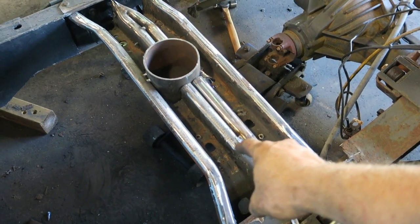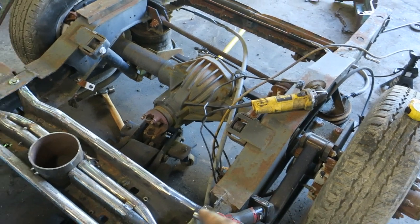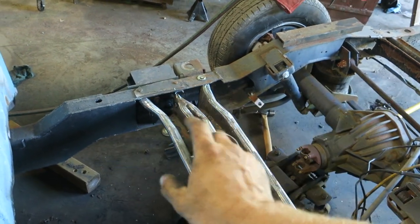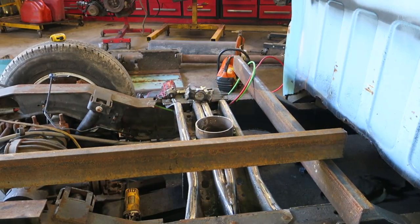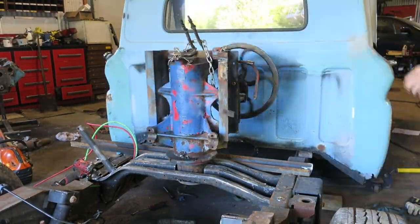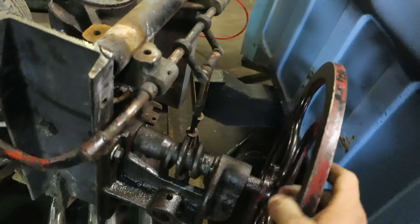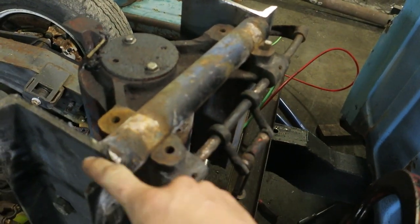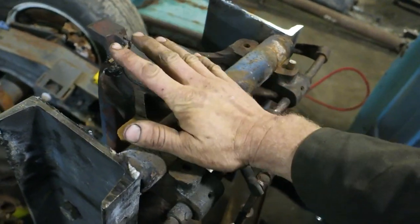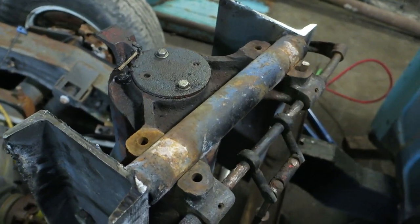We've got the frames tacked in place. The only way to make sure that's centered — because the tires aren't the same size and have different air pressures — is we're going to have to level the frame again front and back, side to side, and then we can stick the level inside the pipe and level it. I'll weld it a little more solid and then get our jig back in again. We've got the turret mounted, it spins around — look at that, what a good day. Now I need to take this thing off. They welded this solid, but I'm taking these off because we are mounting our boom on this one and it needs to spin inside the caps here. I just need to cut them off in a delicate manner.